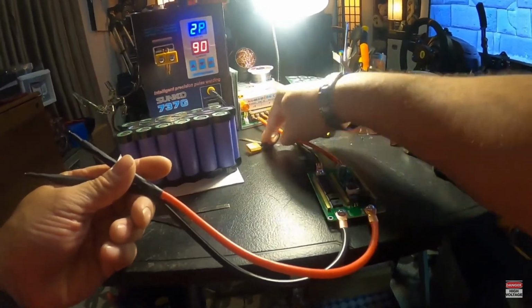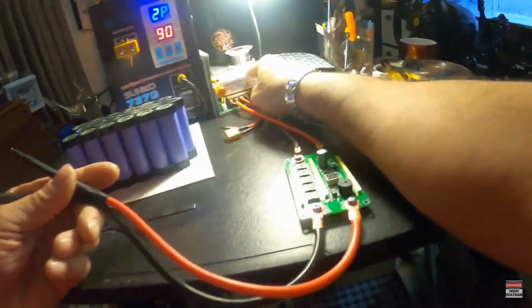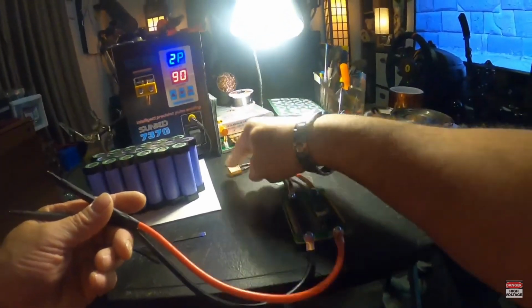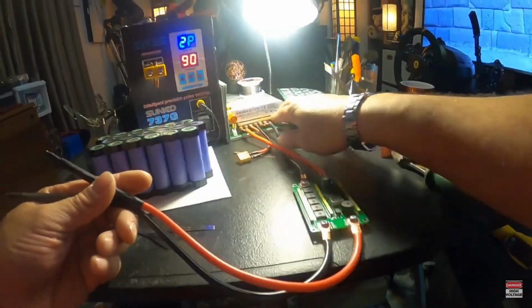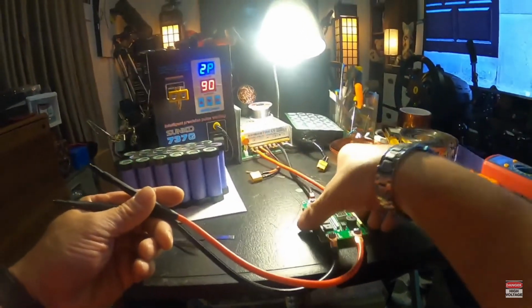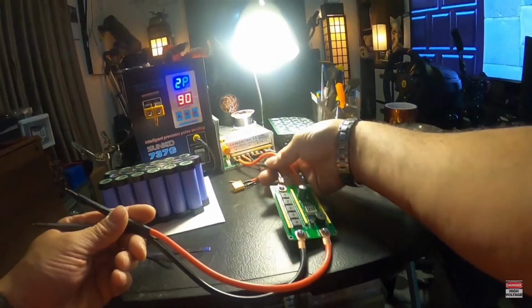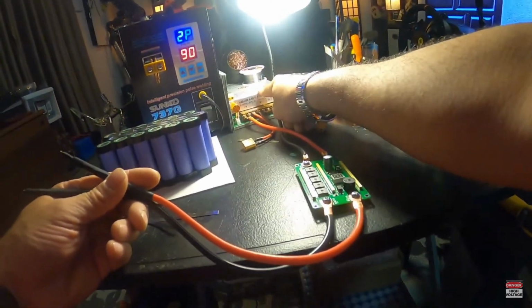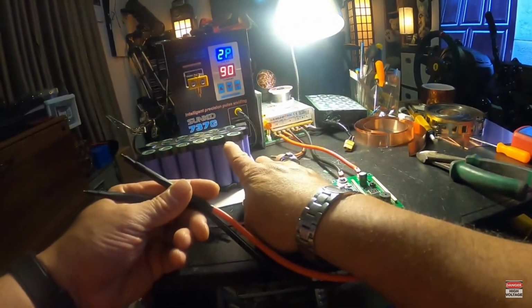What I'm gonna do is put an XT60 on it, and then dial my power supply up to 12 volts. I'm gonna plug it up, let these batteries charge up, but I can also leave it plugged up so these batteries are getting charged and they're constantly connected. And I can leave the leads connected to the power supply. Now this power supply is only 8 amps, okay, which is plenty enough to charge this 12 volt pack.